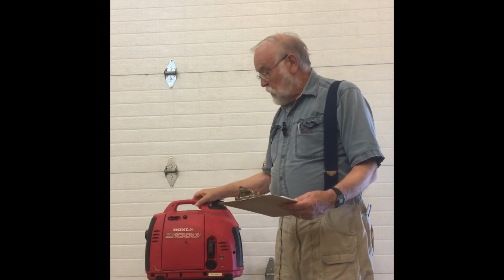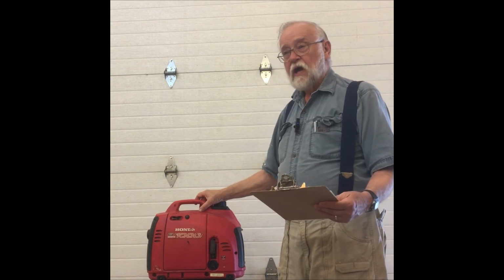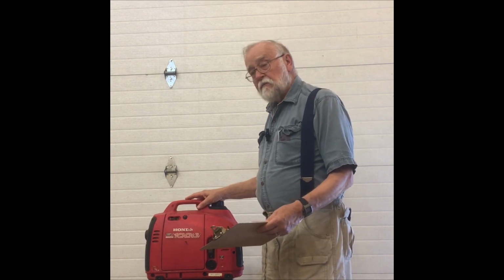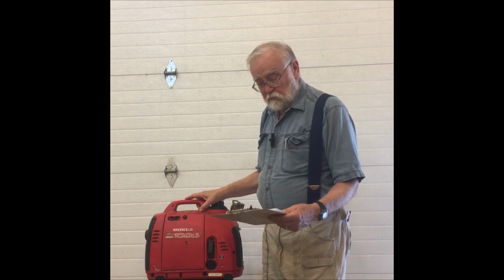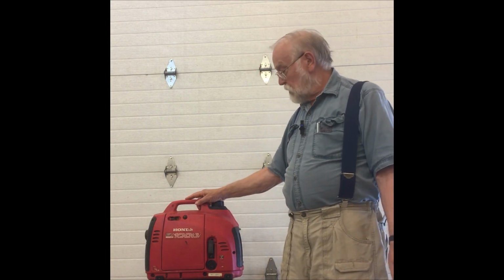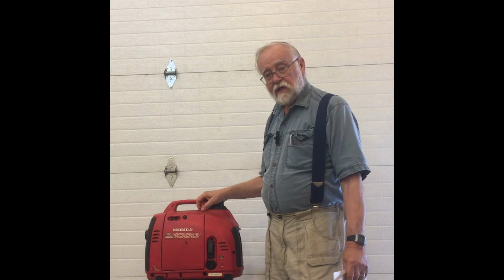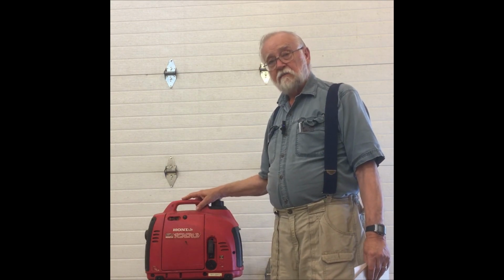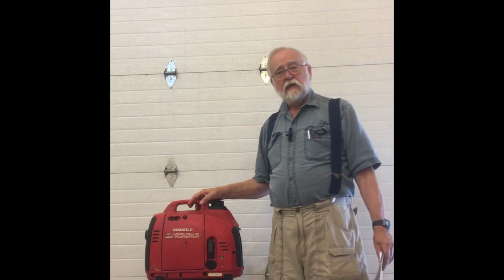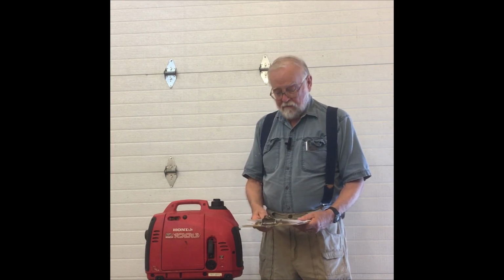But it's obvious from what we have seen here that when the inverter is driving a really nasty load, a dimmer into a quartz bulb, we did get significant distortion. And if we had a number of lamps and dimmers, let's say in a house that you were feeding with this, you could see that probably this waveform could be really pretty badly chopped up. So it's not exactly guaranteed to give you a distortion-free waveform.